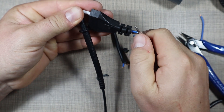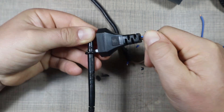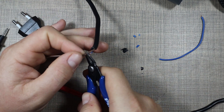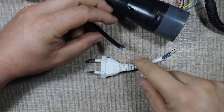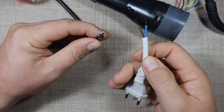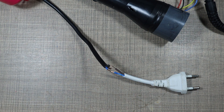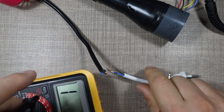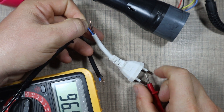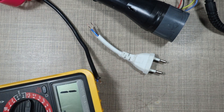I came to the end of the cable and we still don't have continuity, so I'm going to discard this one and find a replacement. Going through my parts bin I found this — it looks about the same thickness, and using the meter I can confirm that this one does have continuity on both wires. So let's replace with that one.